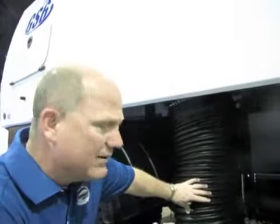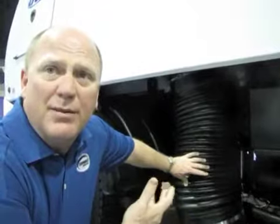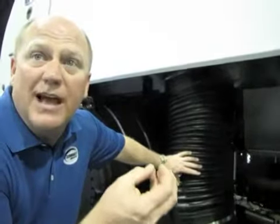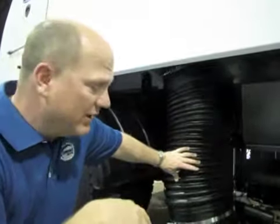We've brought it to the U.S., and from inside the cab you hit a switch and the hydraulic cylinder activates, pulls the flap completely back. It's really great for adjustment for the varying materials you could be encountering, whether it's heavy debris or light debris. For light debris, it pretty much eliminates the bulldozing effect associated with regenerative air sweepers.